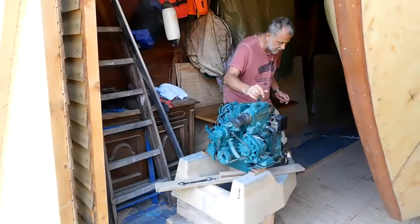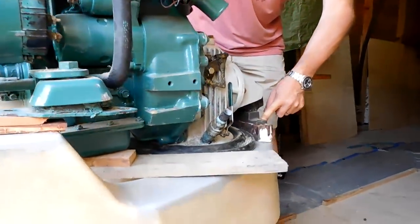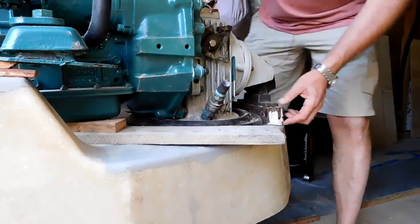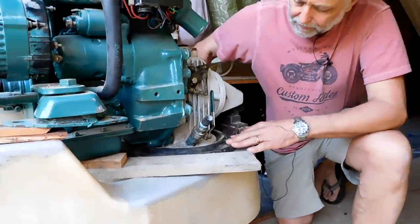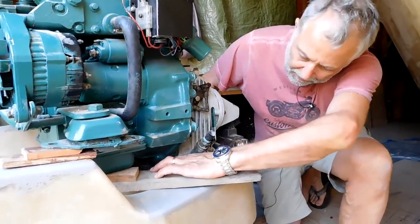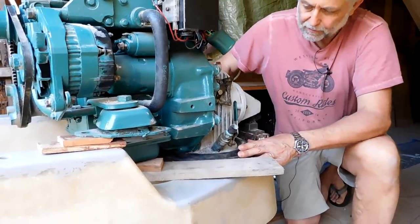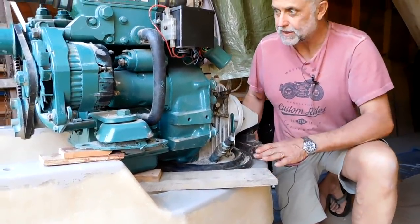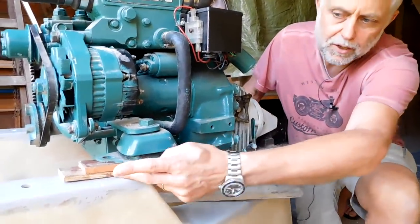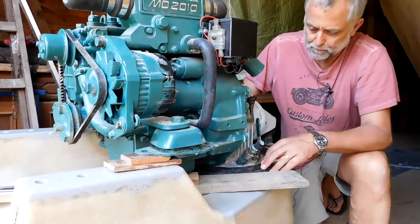And if you come in here, Karen, look at the back there. You see what I've ended up with? I've ended up raising the back end about 2 inches. And I'll come down here. The deciding factor is getting this diaphragm to sit right, so that the bell housing here needs to clear the diaphragm, and that's got to sit at about the right angle. And I think this is where she wants to be. So about 5 centimetres, 2 inches higher at the back, and 2 to 3 centimetres, maybe an inch higher at the front, to get that angle right for that diaphragm.